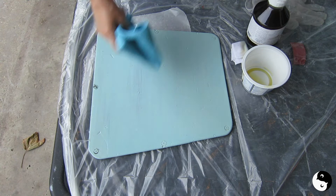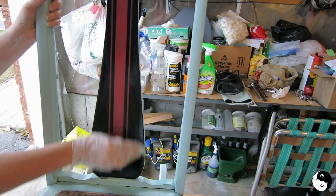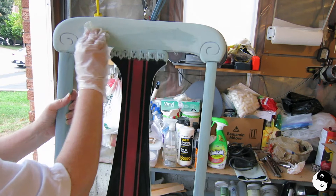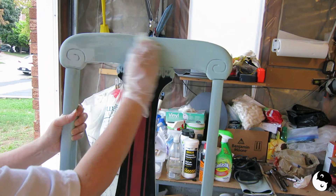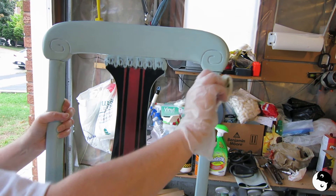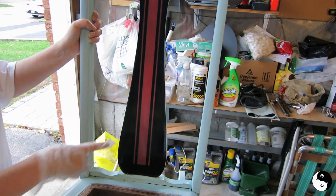I'm going to leave this — I'm starting to lose light, and then tomorrow we're going to come back and finish the rest of the chair. Rub it with the hemp oil and look how it brings up that red. I'm going to come across the detail, making sure you get into every nook and cranny along the sides, just a little bit underneath there. It's not really necessary to wet sand this because I didn't use milk paint on the stripe itself.